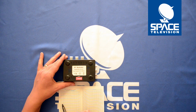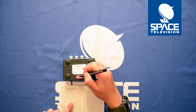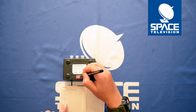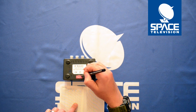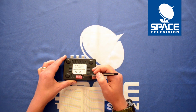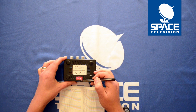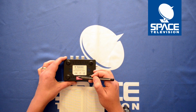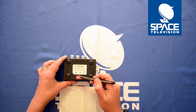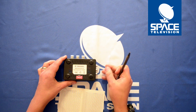Let's say, for example, I wanted to pick channel 32. So the first one is a 0, which is down, then it's a 1, so that's up, then it's 0, then it's up for 1. So there we go. Just to go over that again, if it says it's a 0, it's facing off, being down. If it says it's a 1, it means it's up, which is on. So 32 is 0, 0, 1, 0, 1, 1. And that tells the modulator what frequency to set it on.